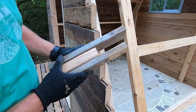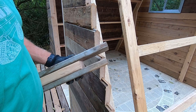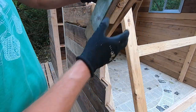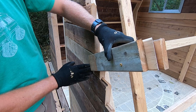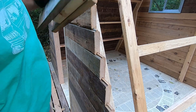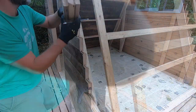Okay, I came up with an idea for setting a fence that I can cut these corners off with. I built this little jig, and it's got just the dimension here between my circular saw blade and the edge. So the idea is I can set this on here and then make a mark here, and every so often where I'll need to put a fence that I can run my saw along. So it's my idea. We'll see if this works.